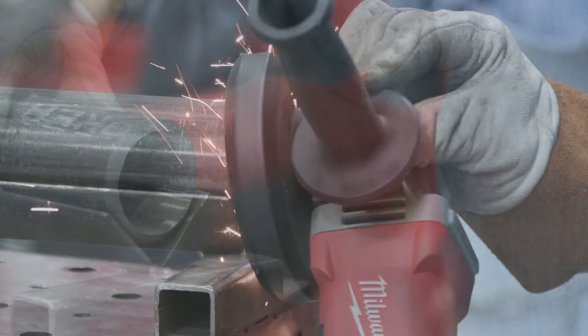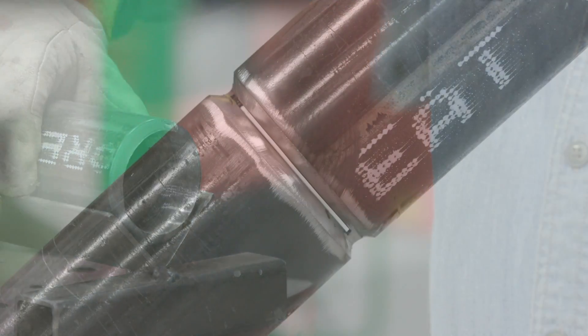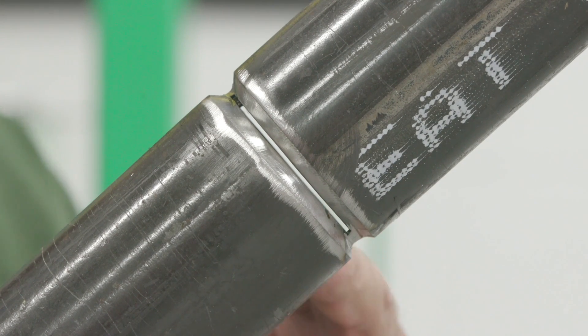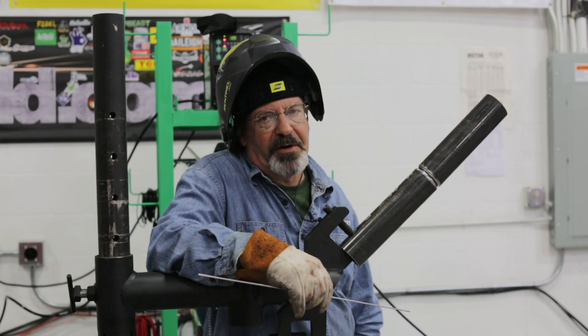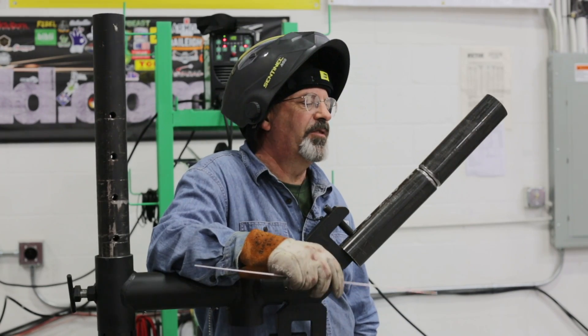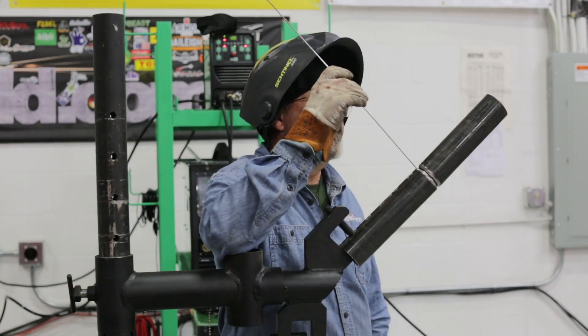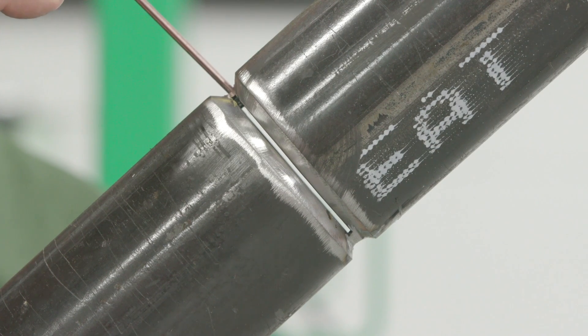I have a standard bevel and I clean the inside of the pipe, I buff the face, sanded it, wire wheeled it a little bit around the edge and I probably have maybe a 32nd. I just lightly hit it with a disc to kind of take the burr off the bevel face there, so it's essentially a feathered edge. And I have a 3/32nd filler wire that I can almost fit through the groove.